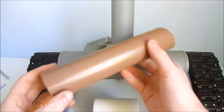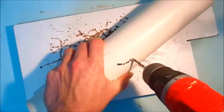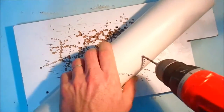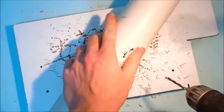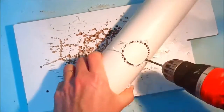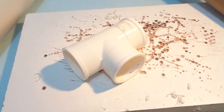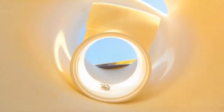And this vertical piece also is a PVC pipe with 50mm of diameter. With the guidance of a template, first I made a hole in the 75mm PVC pipe to attach the 50mm one. And with the help of a T-joint, I could make a good right angle with the two PVC pipes.